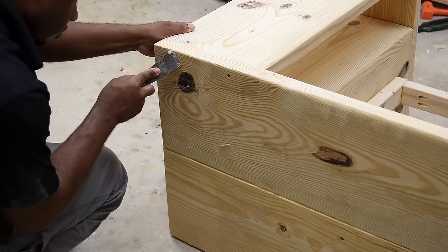If you use a full size mattress the seat will get pulled out at a greater distance leaving an open space, but you can fix that by cutting another piece of wood and attaching it to the side using corner brackets — and this piece can be stored directly under the sofa. If you like the design and want to utilize it as a permanent solution for a bed, that's totally doable as well. I like the way the bookshelf sits to one side of the bed.